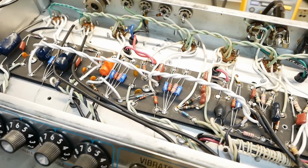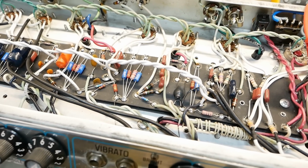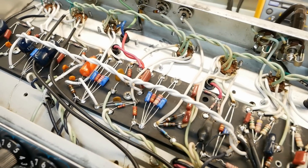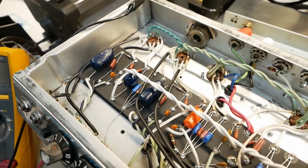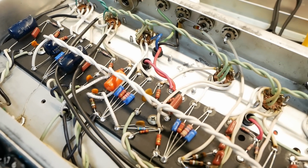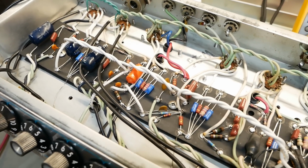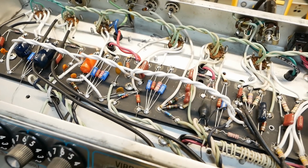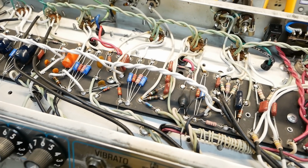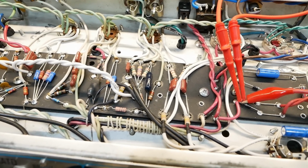In a lot of cases we had to replace the part because it had tack soldered leads, or the terminals of one of the components we could have substituted or used from the old batch. The leads just didn't make it to the terminals because they were in a shorter position previously. So we've got a mix of Vishay, Yageo, and Panasonic components, Panasonic for the film caps there.